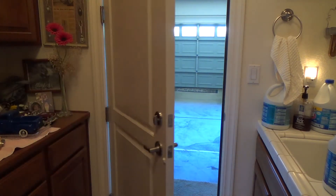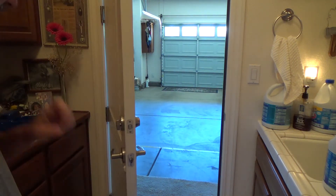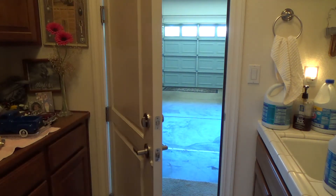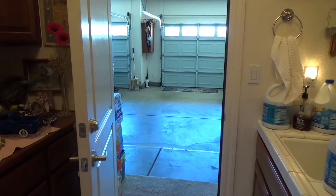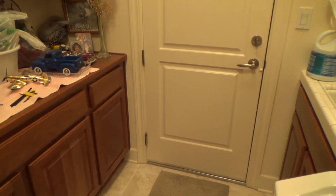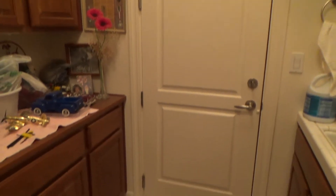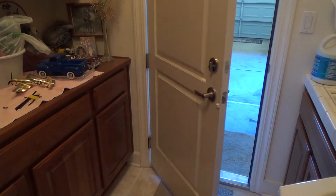I'm going to try it again - open it about three-quarters of the way. I think that's going to be where I want it. A few more times. See, sometimes it depends on which hinge you do it on, because that one down there was slightly adjusted differently to begin with. Plus it's a very tall door, so wherever your self-closing hinge is located could affect how it closes - a little bit faster or slower depending on the location.